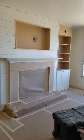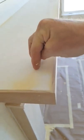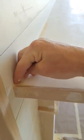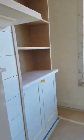We walk through the living room, there's a big mantle, fireplace, bookshelves. There's lots of filling and machine sanding to do on this. There's a different type of filler in the back over here. There's a mantle. There's a big gap from this wood because this MDF sill had a rounded corner. So when they put this face trim on, there's a rounded void there. I filled a huge gap right here. It's almost as wide as my finger, half as wide as my finger, with Elmer's filler. Again, filled a bunch of major stuff with Elmer's filler. Using Festool to sand it down.